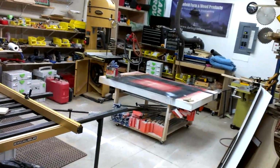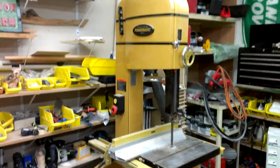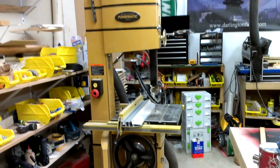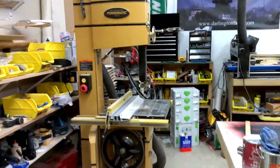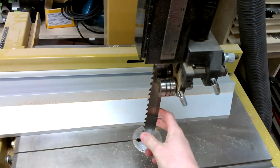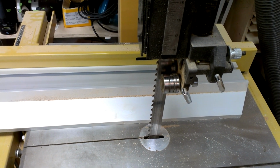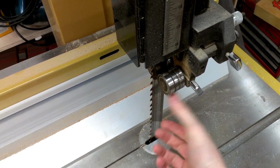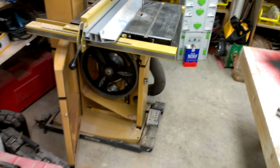So it's pretty nice if you've got a source of wood like that, but not really enough to justify buying a big bandsaw mill. If you just want to make a few odds and end pieces of lumber for yourself, it's pretty handy. And I have not tried using it for scroll cutting. Obviously with this 1 1/4 blade, it pretty much is just dedicated to straight resawing. But it's kind of nice, you could easily change over to a thinner, narrower blade and use it for scroll cutting as well. So, pretty nice machine. I definitely like it.